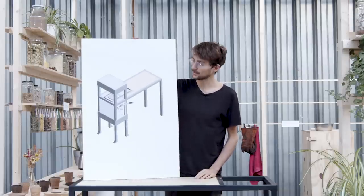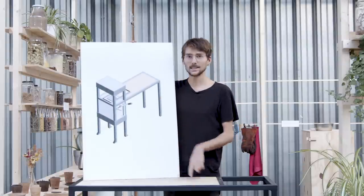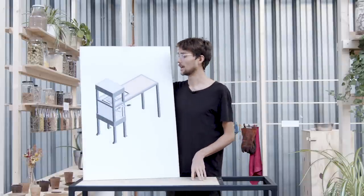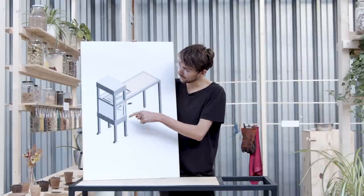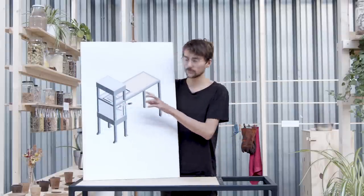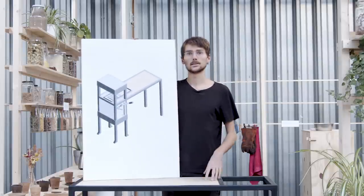All right, so now we cut the whole frame and welded it together. Well done. Next, we will make the sheets. And these are all the covers, and they basically cover all of our hydraulics and the electronics and the heating elements. We will basically cut them with the grinder, and we have a few details in the front sheet and in here that we will also cut with the grinder and use a few tricks with the drill press on how to make the radiuses and stuff. I'll just show you how to do it.